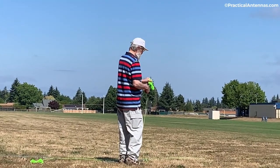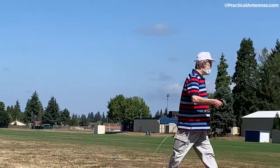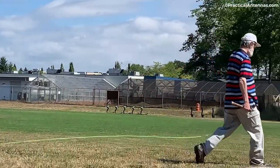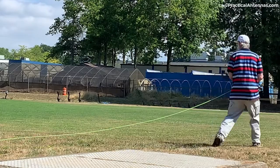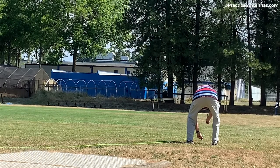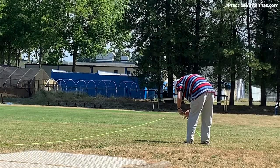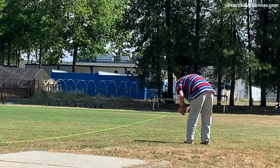Notice how the guy ropes are bundled, so the rope easily pulls out of the bundle without tangling. This is explained in the video on winding rope. The guy rope lengths are typically 1.5 to 2 times the height of the mast. The anchor should be spaced out from the base by at least the height of the mast if they are at ground level. Wider spacing may work better, and trees or other objects are often used. Each guy rope is tied with an adjustable taut line hitch.